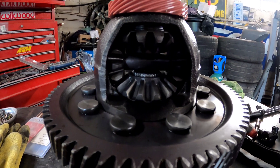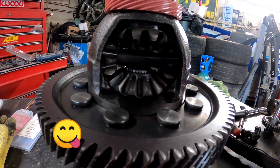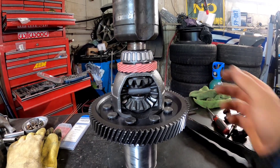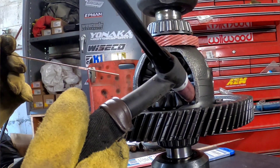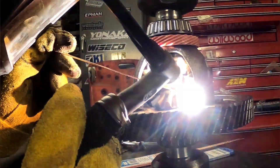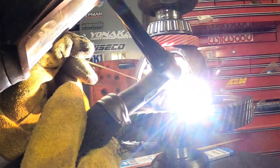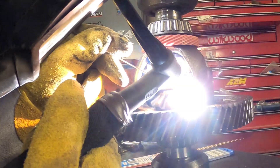It's important to make sure you're lifting the mass as well because they do go on fire, so you've got to be careful. I say that because I have had one catch on fire before. I'm going to give it a shot — do some tacks and then make sure nothing's on fire. You've got to make sure you're really penetrating the steel with a bunch of heat and fill, but the biggest thing is you've got to make that metal hot. It's very thick — you've got to get into the deep spots and get that penetration.